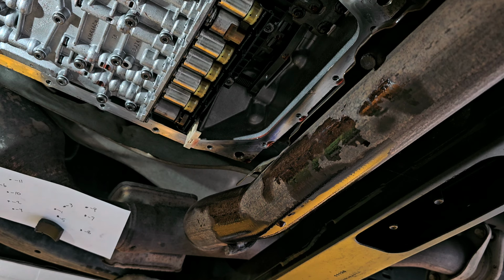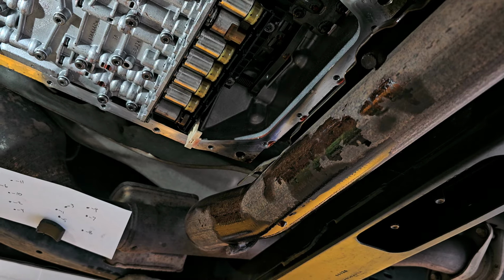And like I said, transmission assembly gel, I use this stuff for everything. I use it for fuel injectors. I use it for anything, but don't use it on brakes. Anything related to brakes. But anything that has an O-ring, as long as it's not brake related, you're fine. If you use it on injectors, it'll more than likely create a misfire for a short period of time, and then that'll clear up.